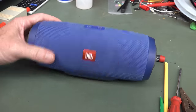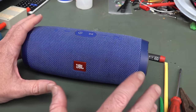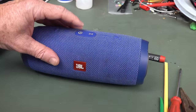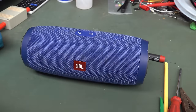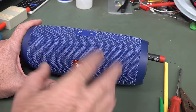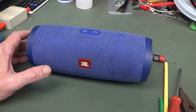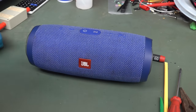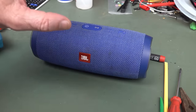A few people said in the comments of the repair video that it was the battery — the battery's gone and it's the impedance of the battery, and it's low dropout. This power-up demo is really designed to show the low bass on this thing, the thumping bass. That particular resonant point was really excessively draining the battery, and the ESR of the battery couldn't provide enough juice, even though it's going through a DC-DC converter. And it's dropping out — maybe the DC-DC converter was oscillating when it's dropping out. But that doesn't explain why it was extremely consistent.